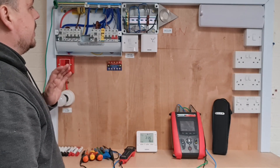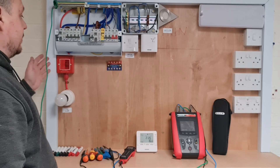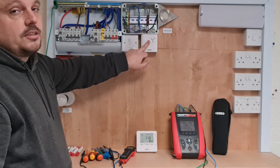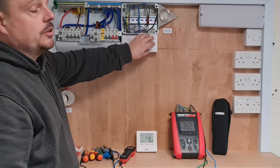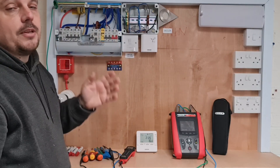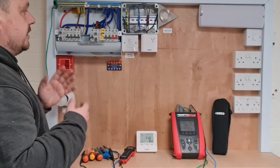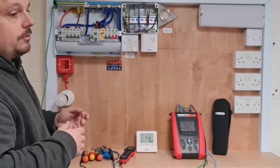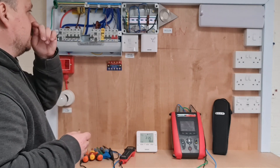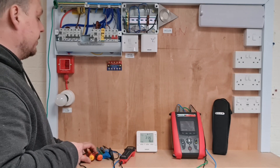Now we've added in this fire alarm. We have to assume that this lamp is the fire alarm - we know that that would have electronics inside it and cause an issue for us. Now we've got the boiler control panel, and this has electronics inside it, so we're going to get some issues there if we start insulation resistance testing that. And of course that's your boiler at the end of the circuit - you don't want to be putting your 500 volts through that between line and neutral either. Effectively every single circuit on this board now is affected, and it says in Guidance Note 3 that the acceptable method is at the reduced test voltage of 250 volts, joining your line and neutral together and testing to earth.